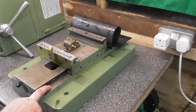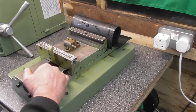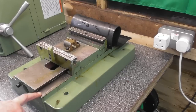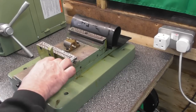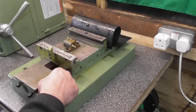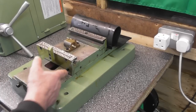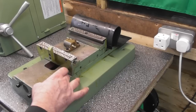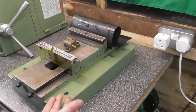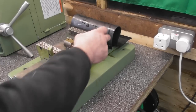First impression when you look at these slideways, you see these scraping marks. What can I say about these scraping marks? It's a token gesture at making it look like it's all scraped to fit. They are ground underneath the scraping marks and obviously the scrape marks will hold some oil, but it's not a scraped fit. It's a ground fit and it's been scraped for oil retention. And it's not even crosshatch scraped — it's just one direction scrape marks just to hold oil in the ways, which is better than no scraping at all.